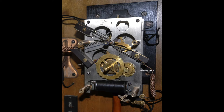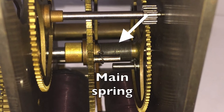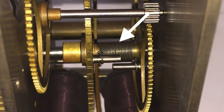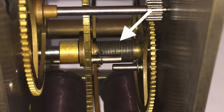So how do these master clocks keep running with no attention from anybody? The answer is through the magic of electricity, which keeps the mainspring fully wound at all times. The mainspring is a small helical wire wound on the center shaft. This small mainspring is only powerful enough to keep the clock running for about an hour, but since it's always fully wound, the clock keeps running and running.